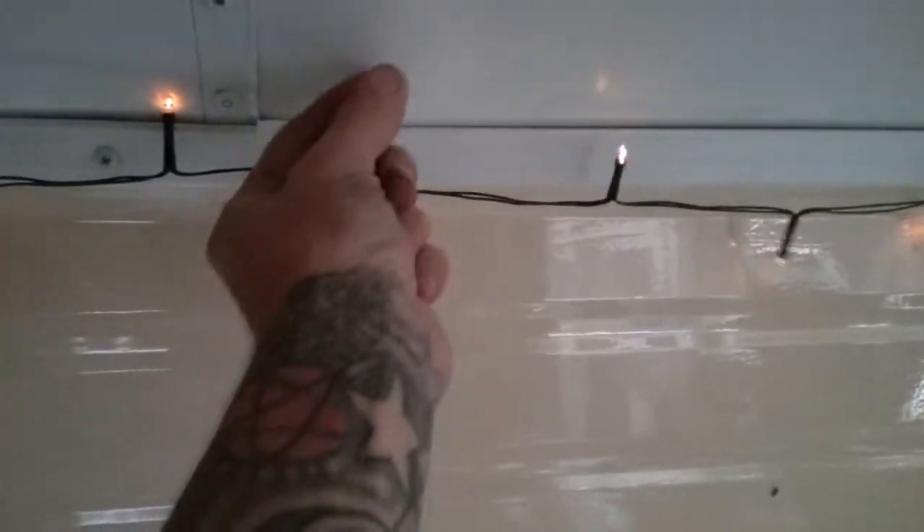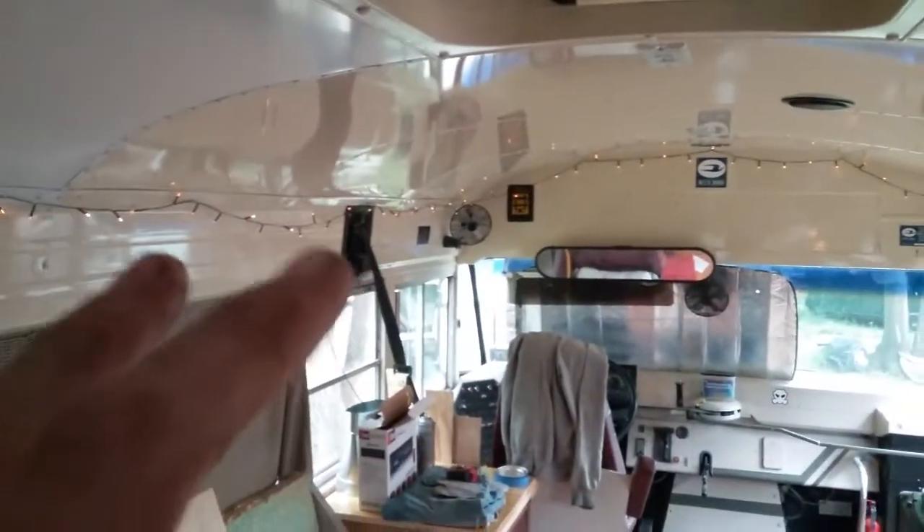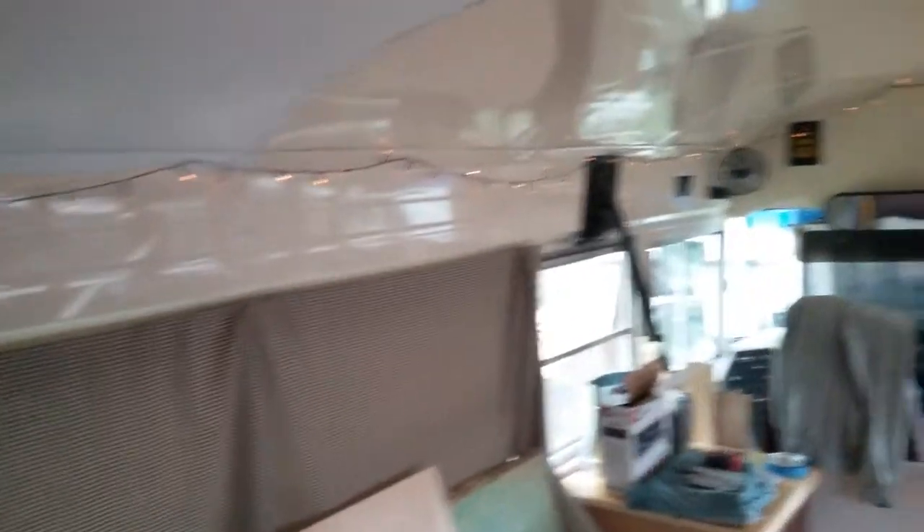So you don't have to snake it through — just take the magnet and pull it to where you want it to go, drill a hole, and the wire will be right there. I'm going to pull the wire from here all the way down to here, take this piece off, drill a hole through there, pull the wire through, and then go from the back of here into the distribution panel. That will give me a switch that goes right to my lights, and I'll have a triac dimmer over here so I'll be able to dim all the lights separately. It'll be two strings — dim eight and then dim eight — probably the front eight and the back eight on two separate dimmers.